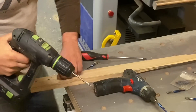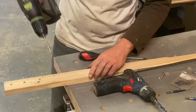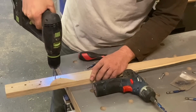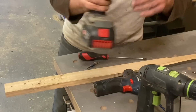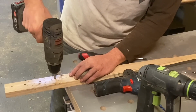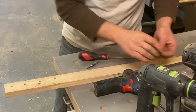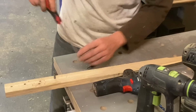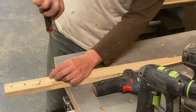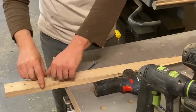Okay, so my normal process for tapping would be, we go in with a drill bit and then stick a tap on the end of a drill and just carefully go in, whoops, in and out very carefully. You use 2 drills and then you've got a really good tap here. And it is actually a very good thread. I like it, and I do it a lot, mainly on templates.